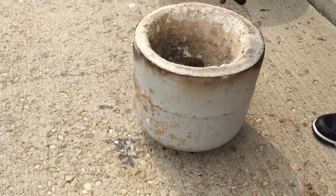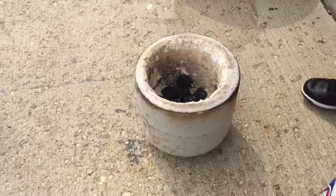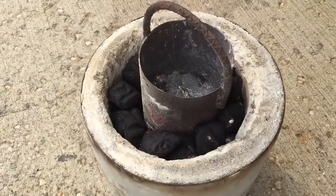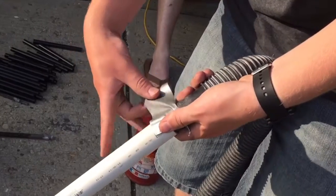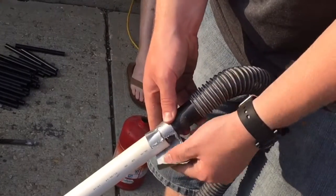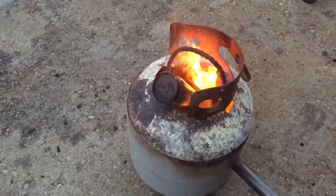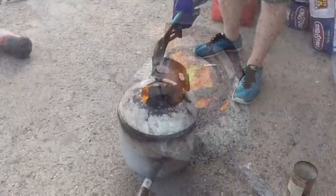Now that we're all set, I'm going to go ahead and put some charcoal in here. I've already had a test run so I know it all works. Basically, what I do is put some charcoal at the bottom of the furnace, set the crucible on the charcoal, and then begin filling around the outside with charcoal until it is full. For my air injection, I'm going to be using a shop vac run in reverse — using the exit port on my shop vac and the hose. I'm going to tape my hose to a piece of PVC, and you can see that in short order it's eating aluminum cans relatively quick. It'll get quicker the hotter it gets, and you'll have to keep feeding in more coal.